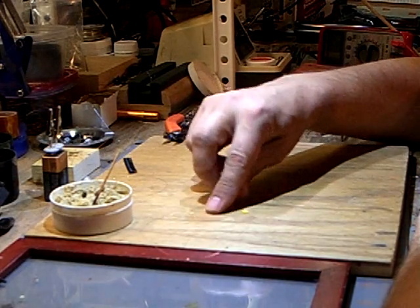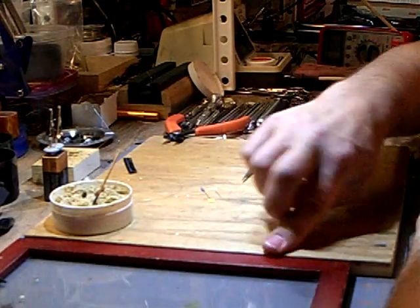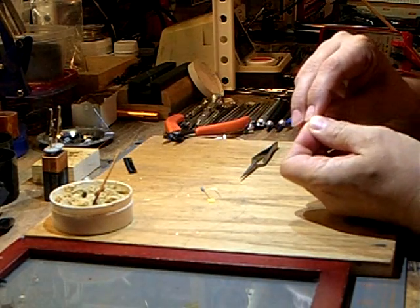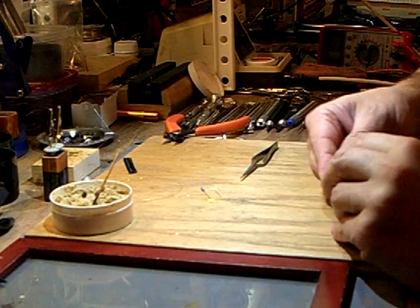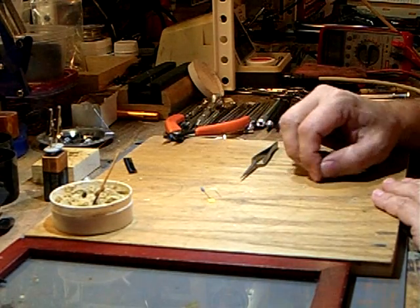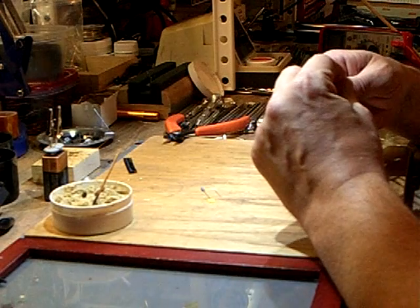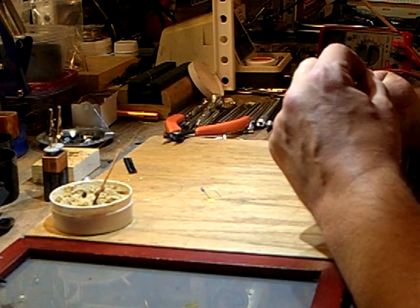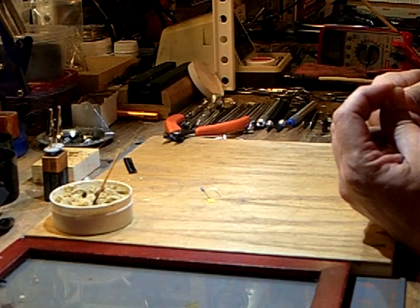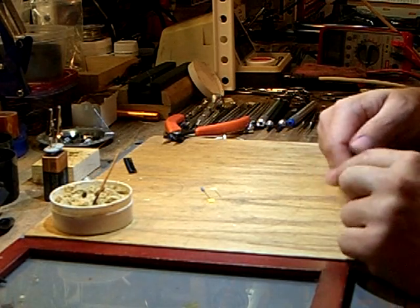For this project we have an 0805 LED, a 1000-ohm resistor available from SBS4DCC, and a couple of pre-cut wire pieces. On the back of the LED there's a tiny arrow, and I always say the arrow points to the minus. The trick is to develop a routine that works well for you so that whenever you assemble these, you always use the same process.